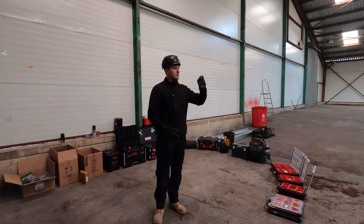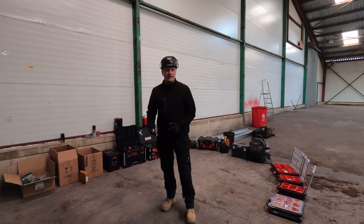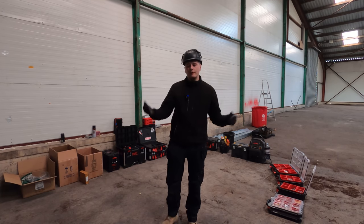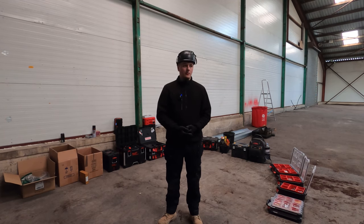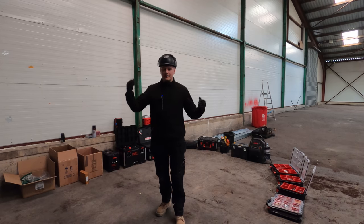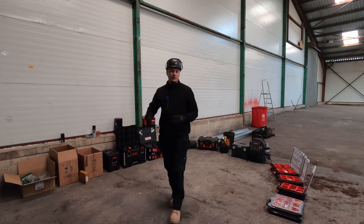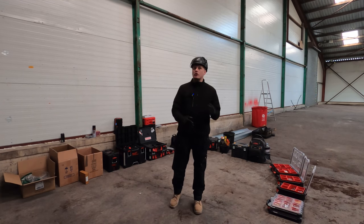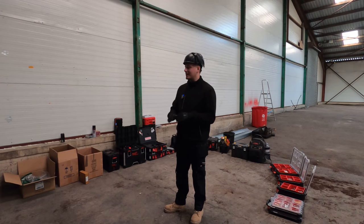But today we've got a lot more materials and a lot more to do. I'm going to be starting the mains on this board here, so I'll take you through the process of that. We're also going to show you some of the bits we've been doing with the lights, and Cam is back. He's going to be getting in a load of G clamps and maybe some armoured cables just to get these new circuits through. Ideally we'd want to be putting in some primary containment, but that's going to be left for whoever takes the unit on.